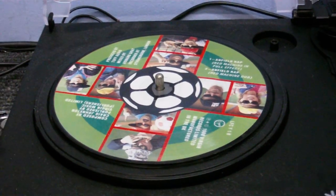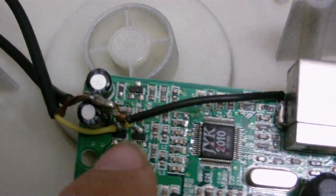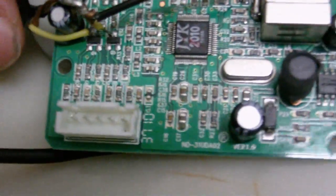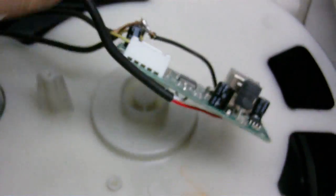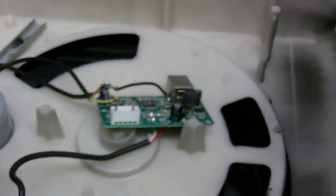Okay, that should be enough. And, to set the record straight, just before I take the circuit board out and replace it with my own experimental preamp, I just thought I'd show you what I've done. You can see these two transistors here — this is the entire preamp for the thing, just those two little transistors. I've soldered the wires onto those two transistors and they go to these phono jacks that I've added. This is the power wire, simply soldered onto where the power goes in. I can remove this circuit and replace it with my preamp.